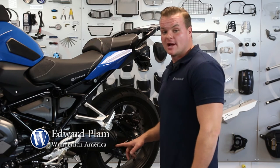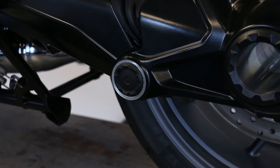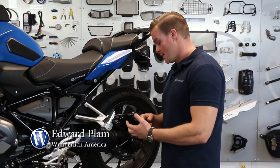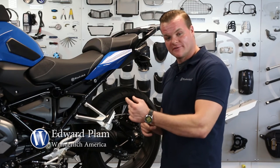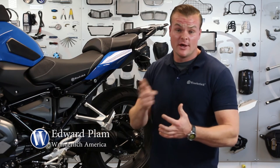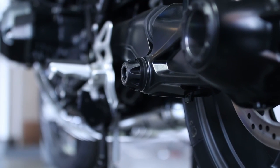There's the black cover that covers the pivoting pin for the final drive. That cover gets popped off with a screwdriver, and this slider slides in. You tighten up the bolt and it's a compression fit, so the tighter you get it the more it expands inside. If you ever have to take it off, you can back it off, shake it, and pull it right out.